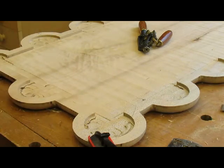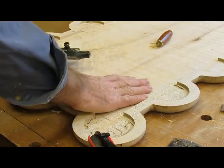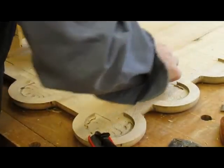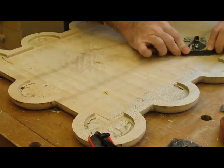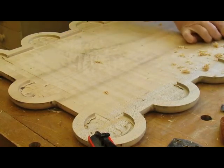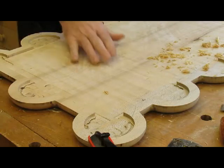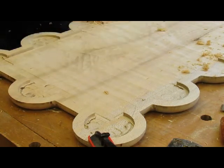Because it's so narrow and you run into the sides rather quickly, I've taken one of the handles off. You can do the middle with the handles on, but with one of them off you have to grab it a little differently — but it does work. I'm working across the grain in the beginning, just as you would with a scrub plane.